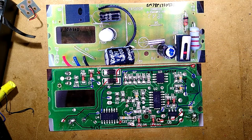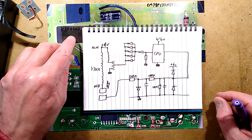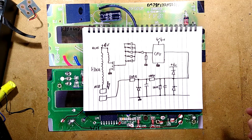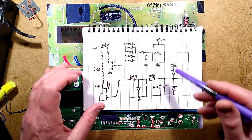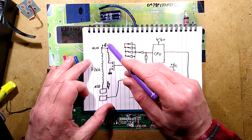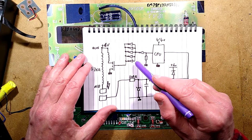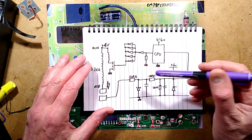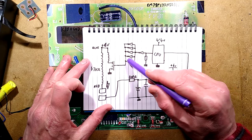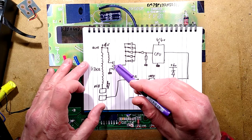Let's take a look at the schematic — I've not got the full schematic, just the bits that really matter. Notably there's a big MOSFET up there which is a 600 volt MOSFET — a K10A60D rated for 10 amps continuous at 600 volts and able to handle 40 amp peaks; in reality it won't see anything like that. When you turn it on, the CPU drives the MOSFET. Because the CPU has a 4.4 volt rail it needs something to shift the level to roughly 6 volts — the full battery voltage — so it uses a 6-gate inverter as a level shifter. That inverter drives all the others in parallel to get enough current to reliably switch the MOSFET on and off quickly.